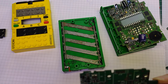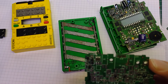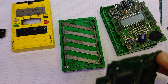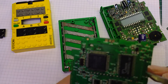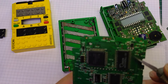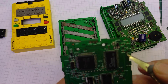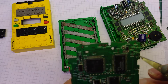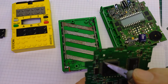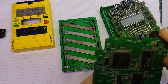So the chances of actually trying to hack it or work out how it works - I think I've got to give up on that. When I opened it up I found that most of the solder contacts were actually corroded as well, or at least covered in a film, and many of the vias were very dirty, as if the chemicals from the battery had attacked them. So it could well be that some of these vias don't actually go through anymore, because of the corrosion from the batteries.